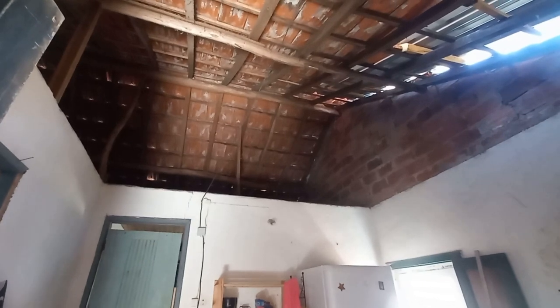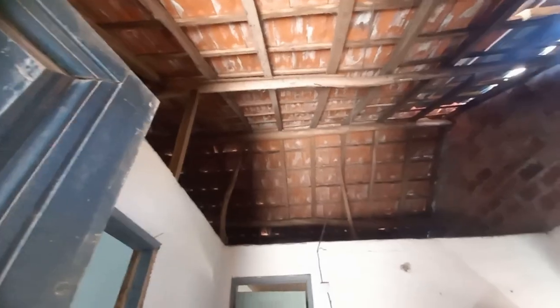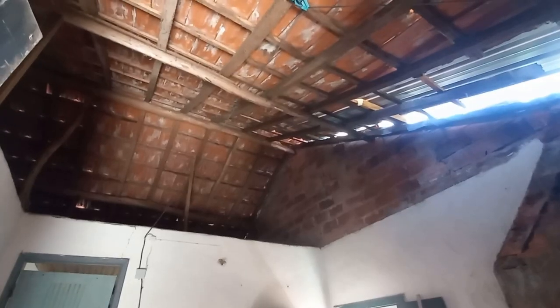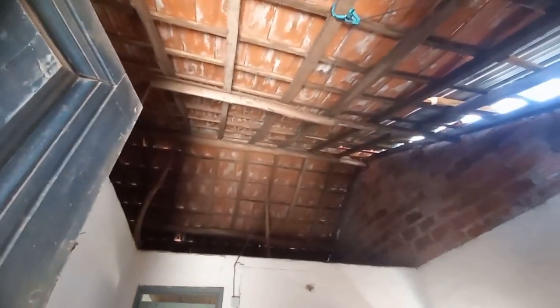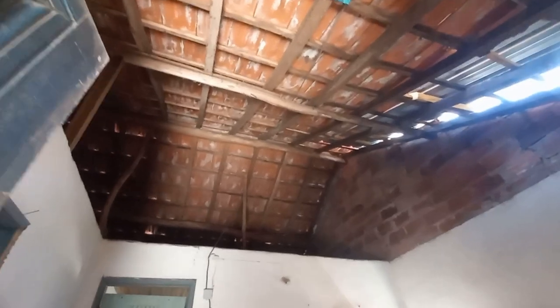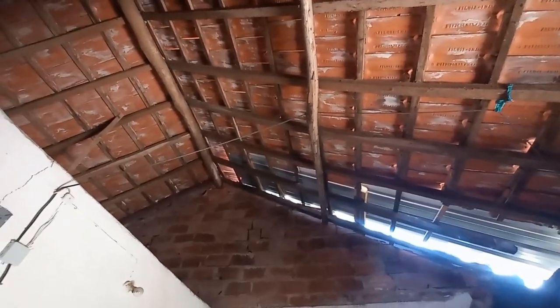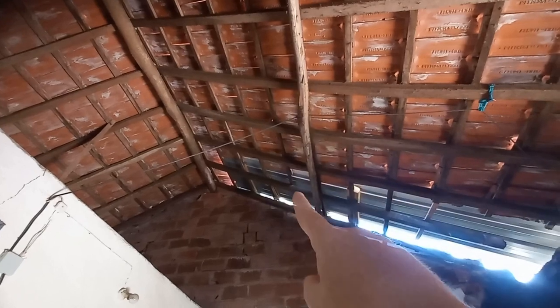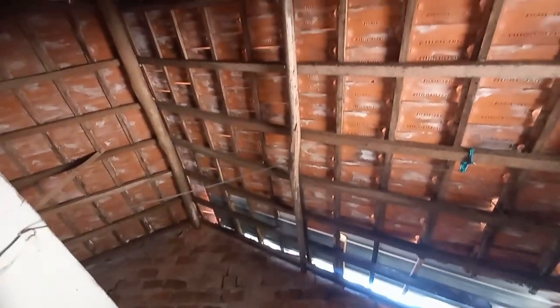We had the owner of the sawmill here this morning, as well as one of his colleagues who speaks English. They came and took a look at our roof. We were ordering 6 centimeter by 6 centimeter, which is exactly the same as the rafters that are existing right now. They didn't think that would be sufficient for a roof. But when they arrived and saw that it was the steel sandwich roofing, they said, yeah, it's more than enough. They actually said, we just need the ridge beam and every 2 meters, another purlin. They call it a chariot here.